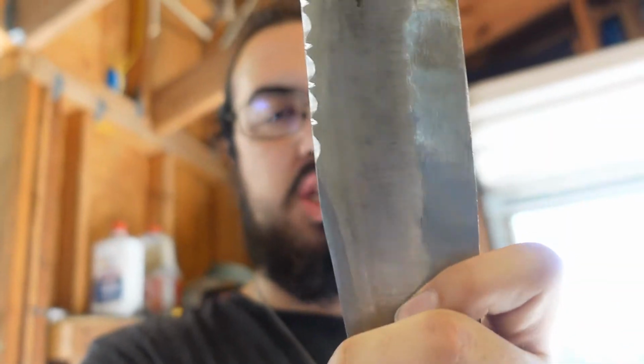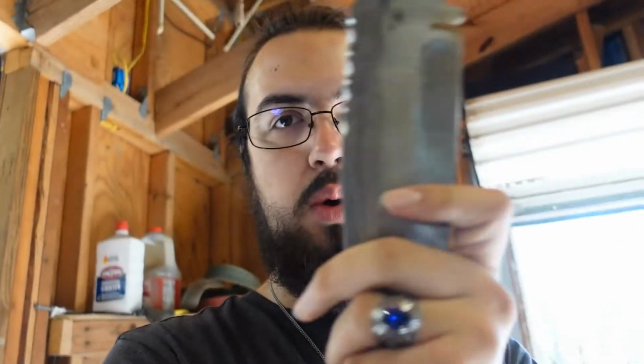As I'm going to clamp this up somewhere, and I'm going to hand sand it at 80 grit so I can get the scratch marks from running this way to running this way. Make it easier on me after heat treat to get it nice and polished up. So, get to that then.